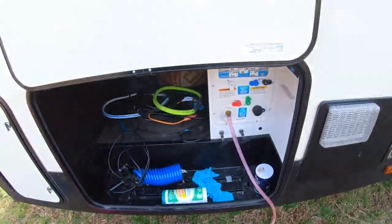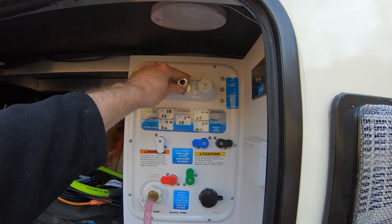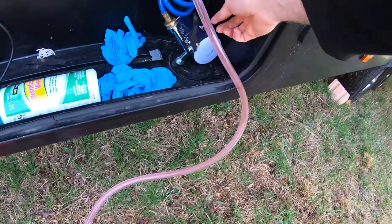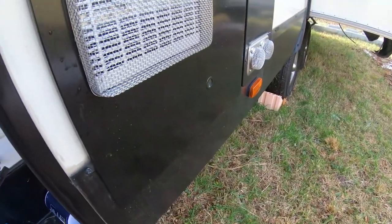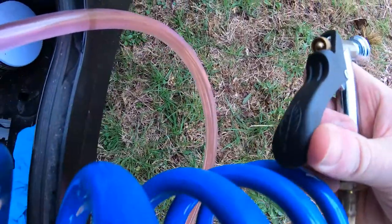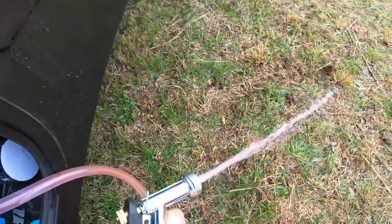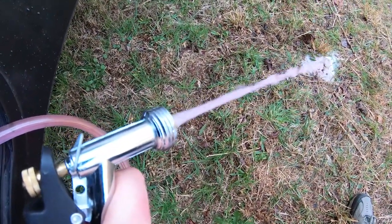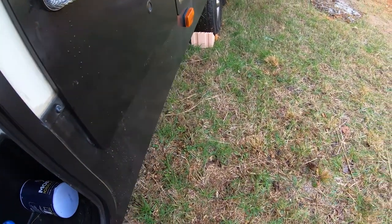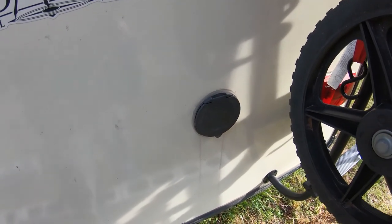So we might be able to just pull this off with two jugs. We're still going to pump it through this outside one and there's one in the back. The one in the back was not working so I might not actually be able to winterize that, which is probably not good. I was not able to get water out of there even without the antifreeze. Let me get the attachment for this and pump some water through this thing. I don't know if I'll be able to do this with one hand. Already got pink there — doesn't surprise me because it's right by the pump so it doesn't have to travel very far. Do the same thing for the other nozzle — make sure you run it for a little bit until all the clear stuff is gone. Then let's go to the back and see if we can get that one working. I've had trouble putting this into the spray port in the back — I don't know if it's rusted shut or what.